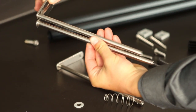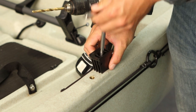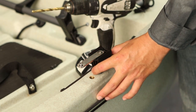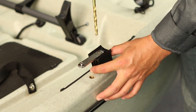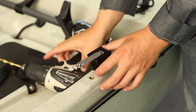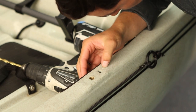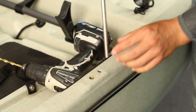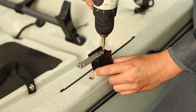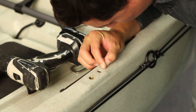You can see the height difference between the old and new crank. We're going to take our new crank, drop it in from the top, and this is going to help us align the base properly. Before we start drilling, we're going to take our drill and push down firmly on the area where we've inserted the crank, and double check to make sure it's aligned dead center. I was off just a little bit to the left, so I redid that to make sure it's perfect — I'm dead on right here with my mark.